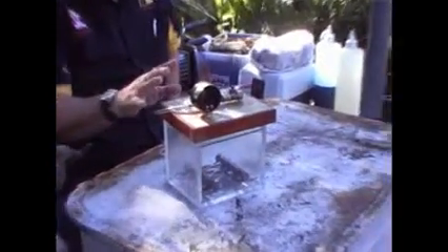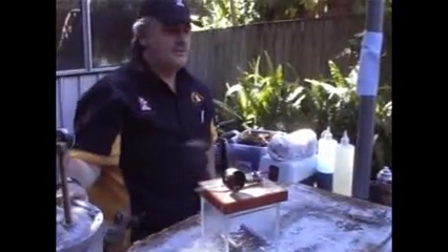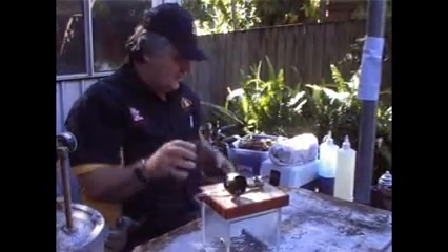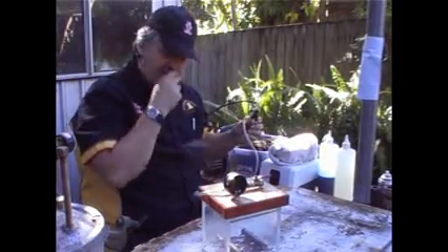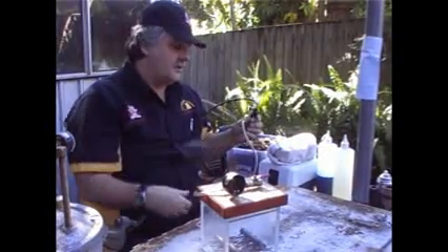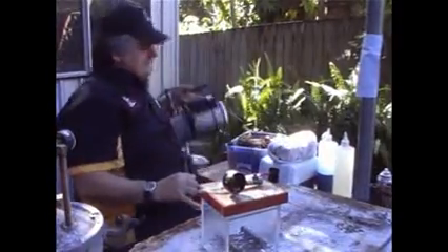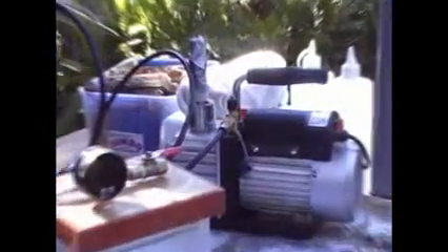You do need a clear chamber for vacuum because as you'll see in the demo, the air bubbles really come out. And for those of you who have done it in their pressure pots, you'll understand why you've got resin all at the bottom of your pressure pot and the product didn't get stabilised. I've got it running to a trap because every now and then the bubbles go all the way to the top and you do not want to get this stuff back to your pump. I'm using basically a refrigerator vacuuming system pump.